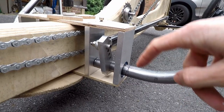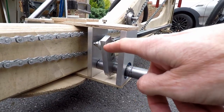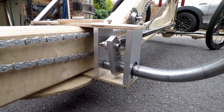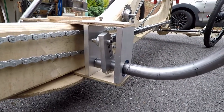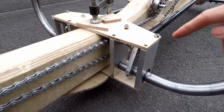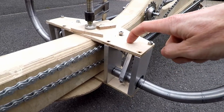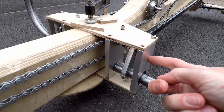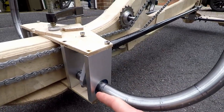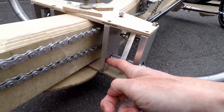At the inner end of the handlebars you've got these aluminium levers. I've got a number of drill holes in them so that the position of the rod end bearing can be adjusted to adjust the throw of the crank. The handlebars are held in place with this assembly here — basically temporary, but I've got a plywood top and bottom, then aluminium uprights, with one large diameter ball race and a smaller ball race on the inside.